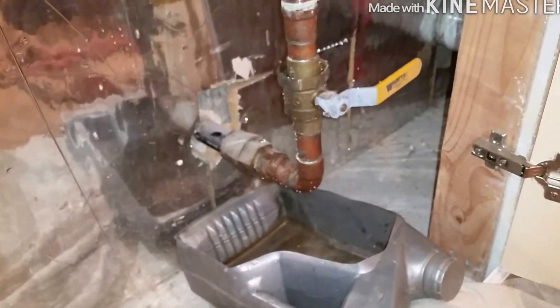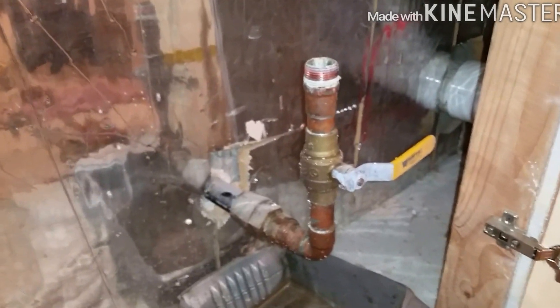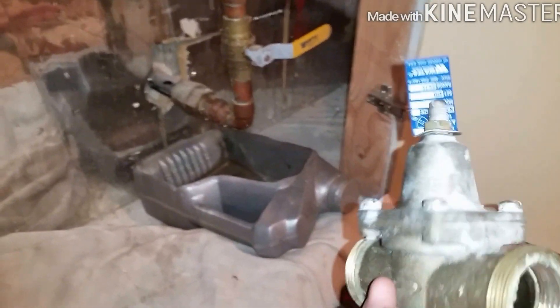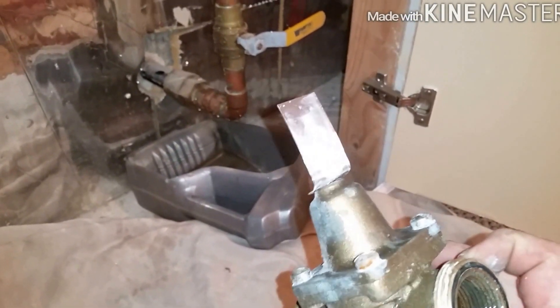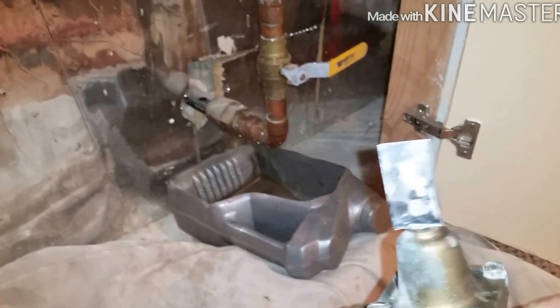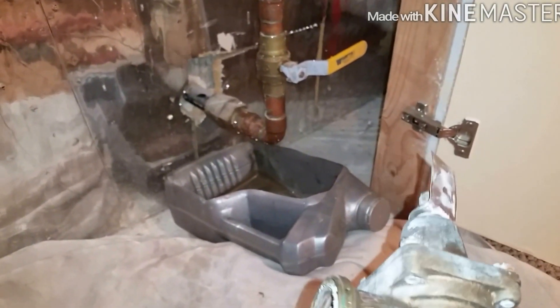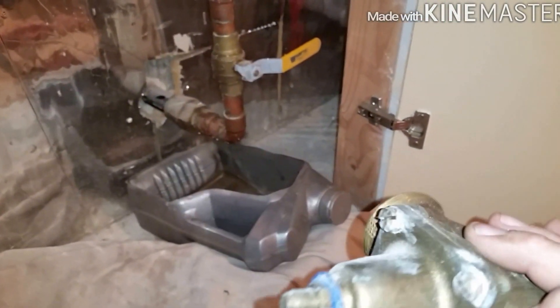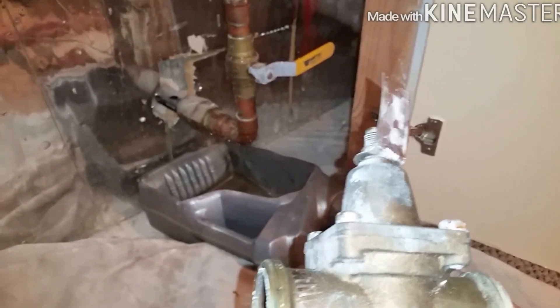You always want to go outside and at least see it — make sure it's unburied so you can get to it in a rush. What these are designed to do — if people don't know — is if your distance from a pumping station or water plant, they've got to increase the volume and pressure to the neighborhood. So it might be 100 PSI coming in from outside, but your house should not be running like that. It should be between 50 and 75 max — more towards 50 to 60 is normal. When these go bad, you get very high pressure, very low pressure, or both.